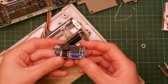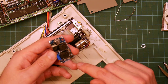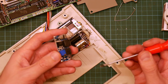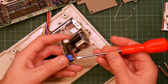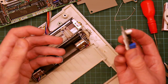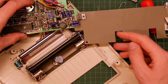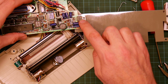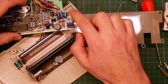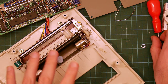Here is one of them — it's a cheaper Chinese adjustable power supply module. You feed voltage in, out comes electricity at a particular voltage. You can adjust the voltage by rotating this pot. They're cheap, cheerful, and work reasonably well. So I'm going to use a couple of these. This board uses two regulators: this is the one for the electronics and stepper motors, and this is the one for the pen solenoid because that uses tons of current. So I'm going to stick with the same plan and use two different power supplies.